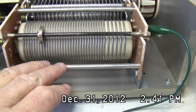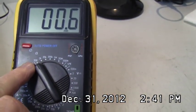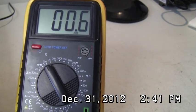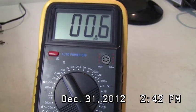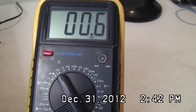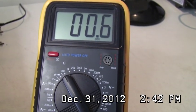That raspy sound proves there's something wrong with the coil mechanism mechanically. If you don't have a DVM with a diode function, you can go to ohms. I'm on the lowest scale, which is 200 ohms, and I'm getting 0.6 — six-tenths of an ohm resistance. I'm cranking it back and forth all the way to each end, and you can see it's hardly fluctuating — maybe 0.7 to 0.6 ohms. This shows my repair job was successful.